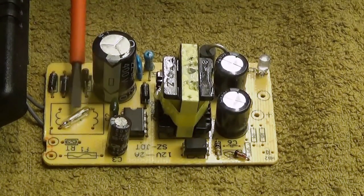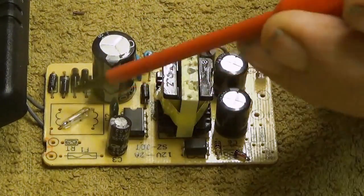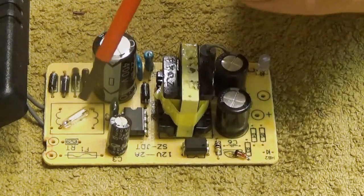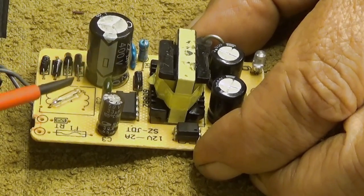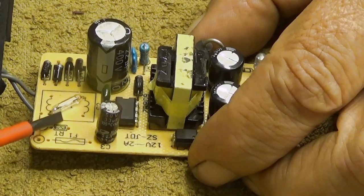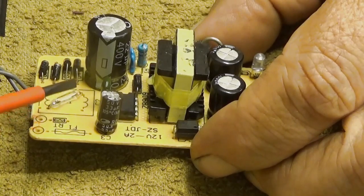And then this glass tube here, this is actually a fuse. But it's not in place of a fuse, it should be sitting here. But instead it is sitting here. And here we should have a coil, which should actually be filtering things. And the filtering is not for the converter itself, but to filter out stuff so that it shouldn't transmit disturbances back to the mains, to the power grid. So that's the purpose. If we would have that kind of inductor here, that would be that.